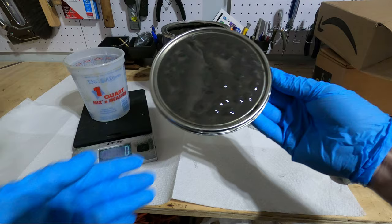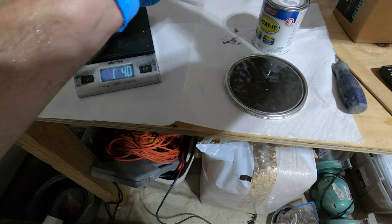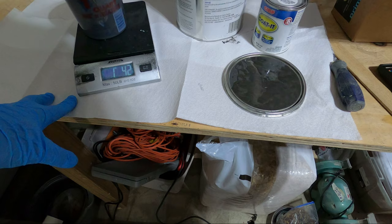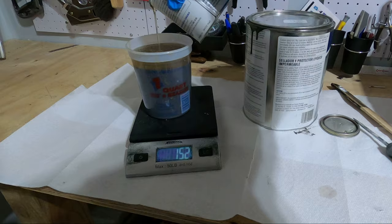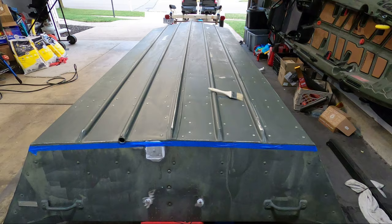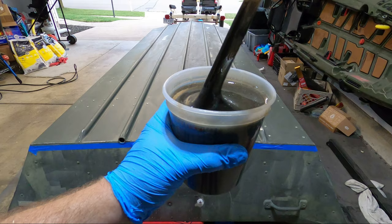I'm about three quarters of the way up on the resin. The scale reads 1042 grams, which means we need 149 grams of the activator. A little bit extra at 154 grams — those extra couple of grams aren't going to hurt. Now it's go time. Mix this up, and as soon as you mix, you've got to start painting. Now a couple ways you'll know it's starting to activate: temperature — it will physically warm up — and viscosity — it will start thickening up. This looks pretty good to me.